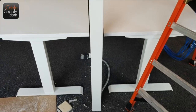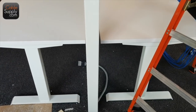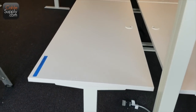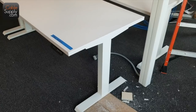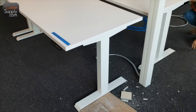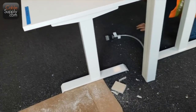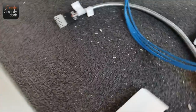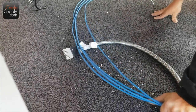And the reason why we're going to do that is because the cubicle guys didn't do their cubes in time, and this place opens up in 2 days. So you got to have voice and data networks running and up and going, and so that means that this cable is going to run across the floor. And I'm going to show it to you here shortly how it's done. But on the cable side, if you see, there's a little power cord there. That's the power. It's going to eventually go into the cubes.